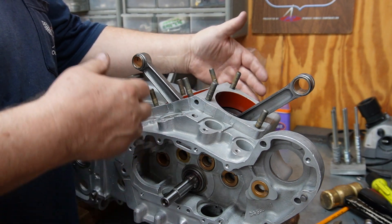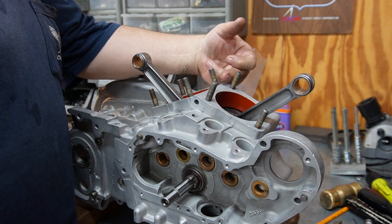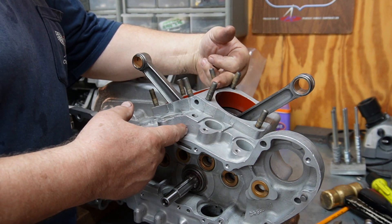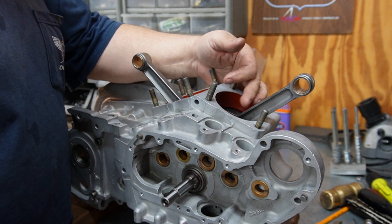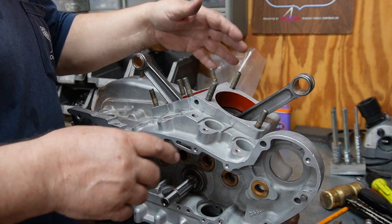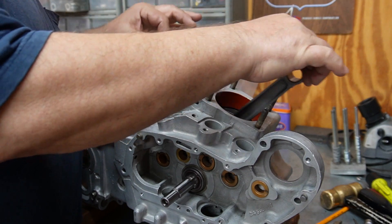The reason we're doing that is because when you tighten the Timken bearing up, it sets the free play on the crank. There's going to be about one to two thousandths of end play that will allow the crank to move to the right. We know there's not much clearance on the right side because the pinion race was hitting the screw for the lock tab on the flywheels. So we need to check that to make sure that with everything together in assembled final configuration, there's still clearance there. Beautiful — still has clearance. So this is now good to go.